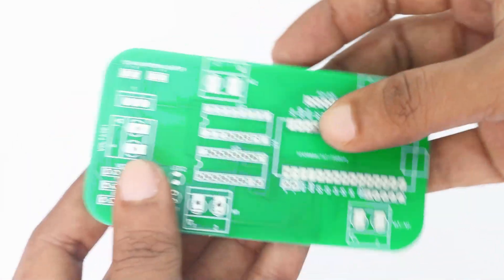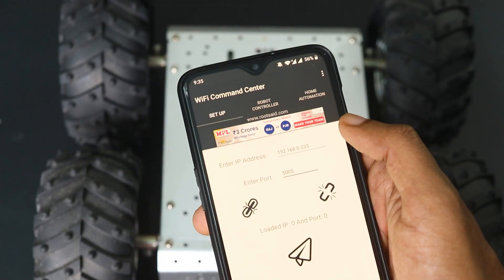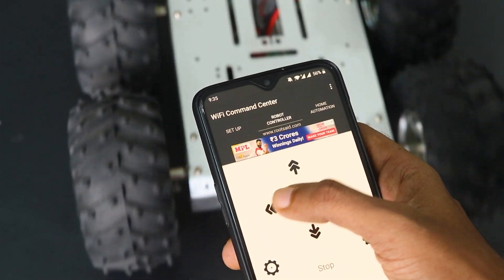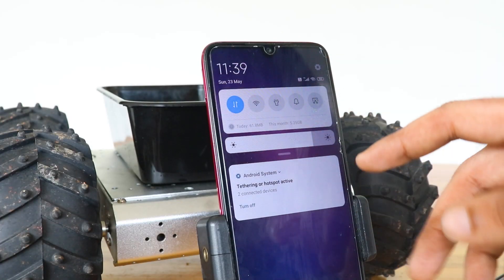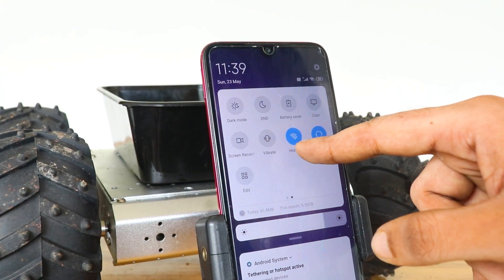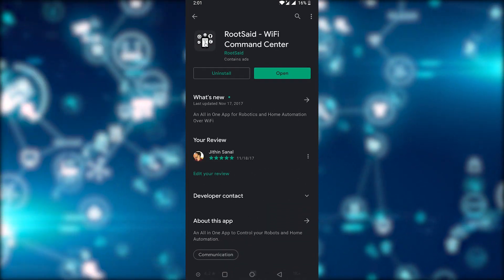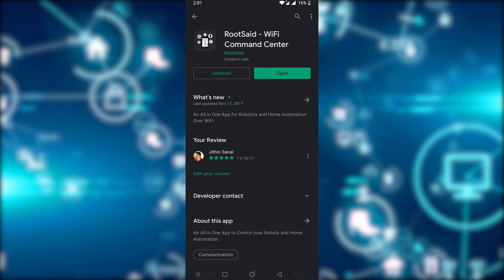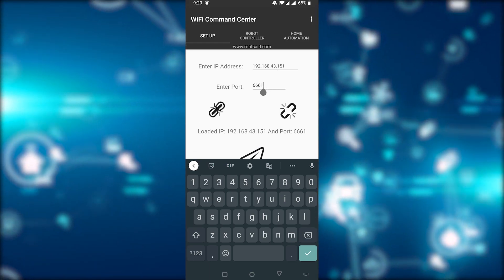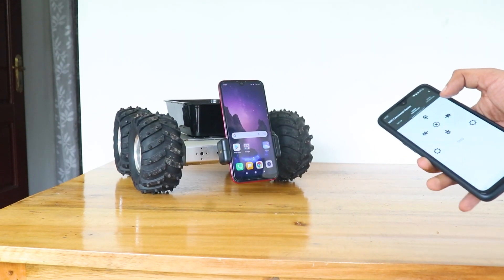Once we get all the components and the PCBs, it's time to solder them together. Solder all the components onto the board and make sure to check the polarity. After soldering, the PCB looks like this. This robot is controlled using an Android smartphone over Wi-Fi. The app we'll be using is called Rootset Wi-Fi Command Center, which you can use to create home automation and robot projects using Wi-Fi. After installation, open the app, enter the IP address and port number of the robot, and in the robot controller tab you can send commands to the Arduino using simple tap buttons.